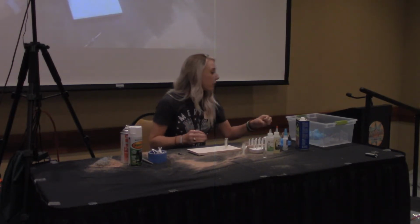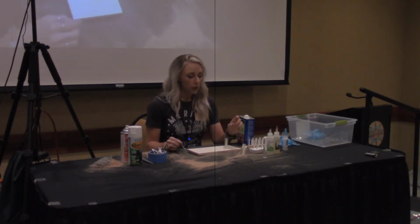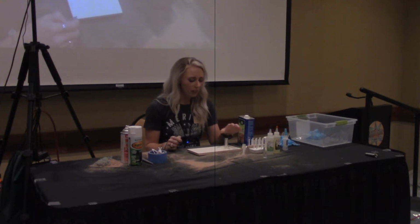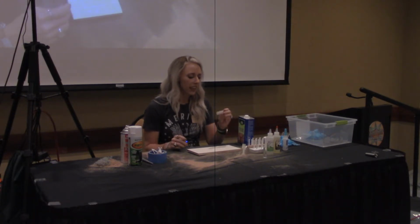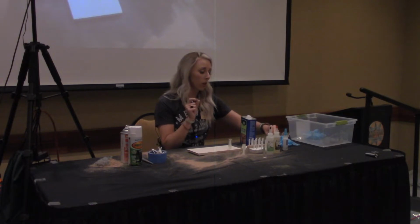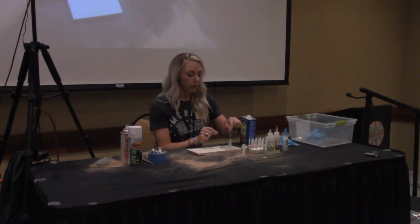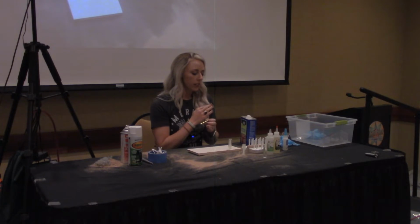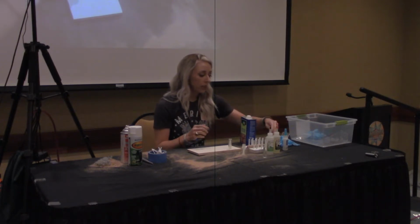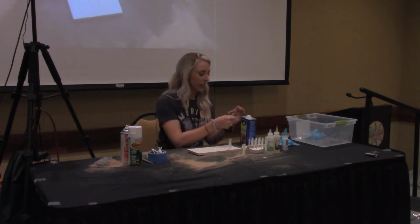Why it's important is because, number one, it's going to give you a foggier, murkier looking end result, and that's no fun. But two, there's a very small amount of space that you have to work with between the tube and the drilled hole. So you don't want anything extra to impede you being able to glide it in there without ripping off the paint that you're gonna paint on the inside.